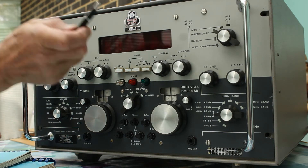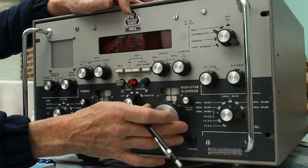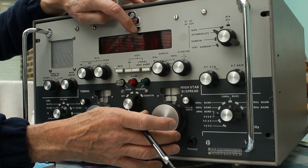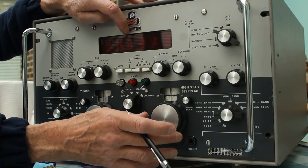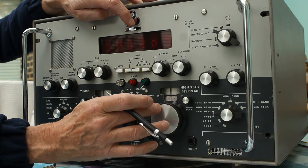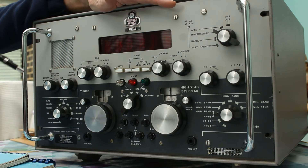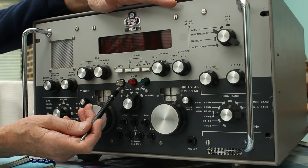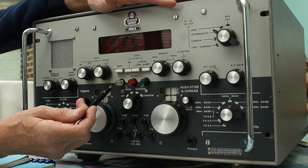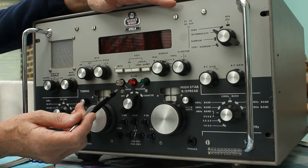There is still one fault remaining on this, and you can see it on the counter — a lovely clear readout: 0, 1, 2, 3, 4, and then we get multiple lighting of the Nixie tubes until we get to 9. That fault is thermal or capacitive, because it will shift as the receiver's been left on. The oven light here is lit because at the moment the oven is being heated; the minute it reaches temperature it will go off, and then it will continue to fluctuate on or off depending on what the bi-metallic temperature sensor is doing in the oven.